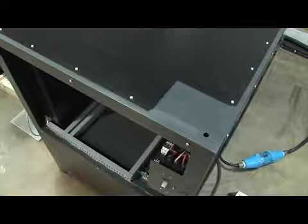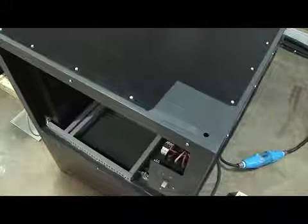The electrical connection to the unit is made through the roof. As shown, the roof has black panels that are mounted to the gray frame of the unit. There is a notch cut out of the panel on the back right side for the customer to punch out a hole to run the proper wiring to the unit.